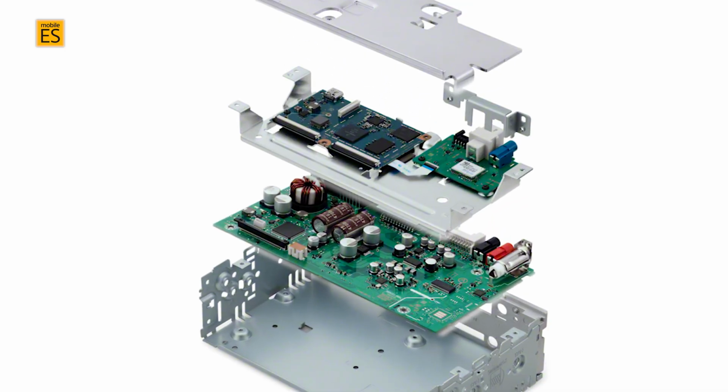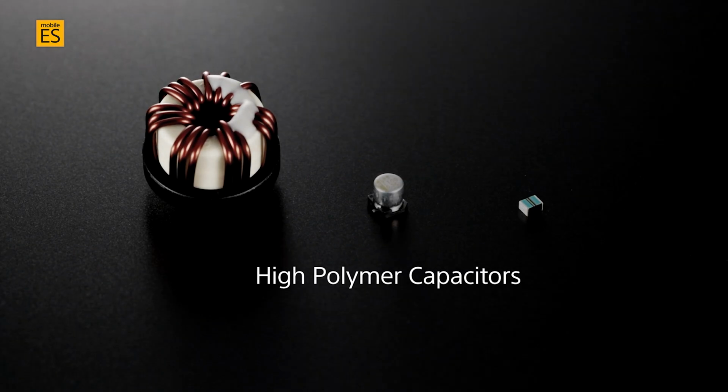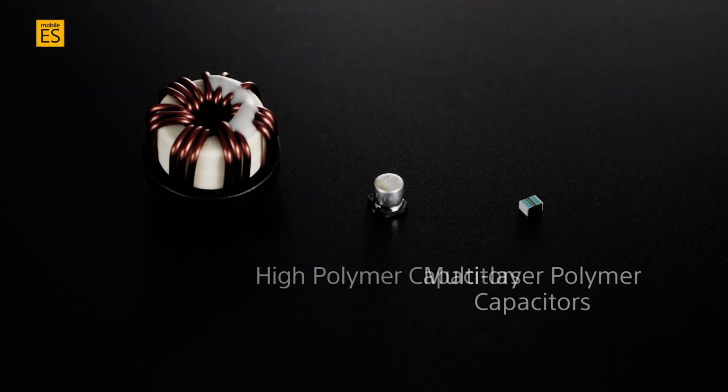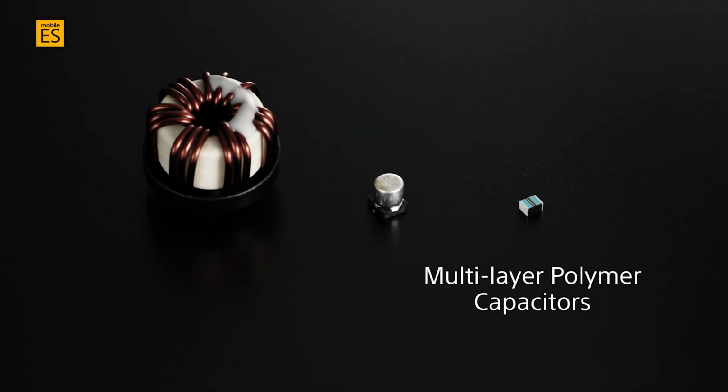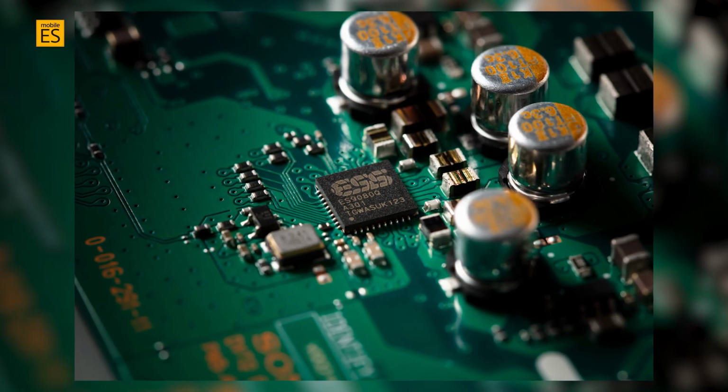On these boards, the capacitors and coils are uniquely designed to be able to reproduce high-quality sound, and all applicable components have dedicated power and ground channels to eliminate any power loss regardless of what features are being used in the radio. The heart and soul of these Mobile ES radios is the exclusive ESS9080Q 32-bit digital to analog converter.